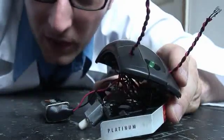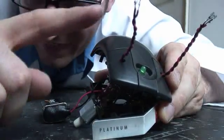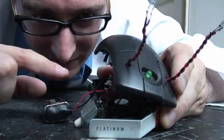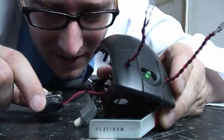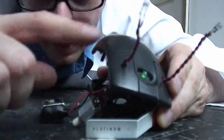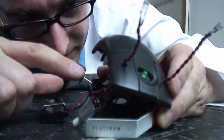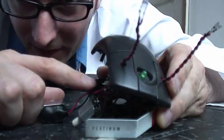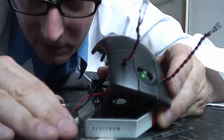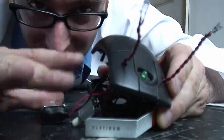All right, there were a few problems. One was I had the actual infrared receivers instead of the emitters hooked up, so I've got that changed — that fixed it. Then I've got a little bit of a problem in that if I could go back and do this again, I would only use solid core wire on the eyes and not on the insides. Because I keep having the problem where I'd smoosh it down and some of the little connections break. So solid core only if you need to form it — otherwise, always use the stranded braided stuff.